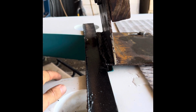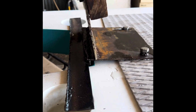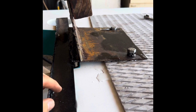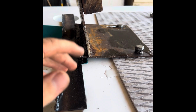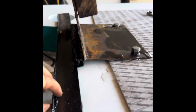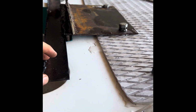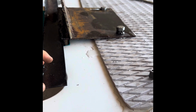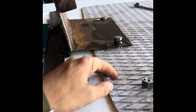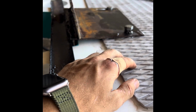So I cleaned up the holes where the mounts went and I filled them with fiberglass epoxy to make a cavity. And then I filled the cavity in with JB steel stick to actually hold the bolts, and that's worked pretty well. And then you can see that back piece I did there, and we'll get into that in a second. But basically, what I was explaining here is I had to repair the cavities there that were made when it ripped the mounts out.